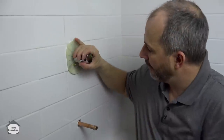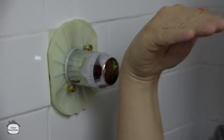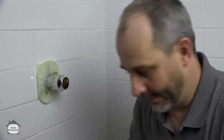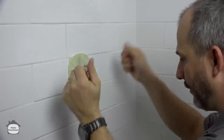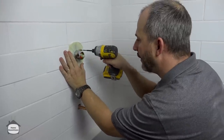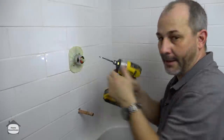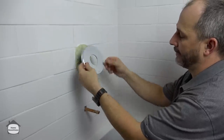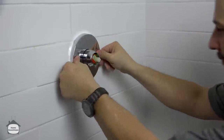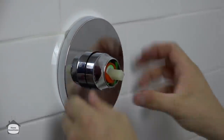When you're installing your valve in the wall, don't be afraid to install it at just one degree slope — that way all the water that gets into that valve will drain out. There's a gasket; tighten up your screws, just snug — don't over-tighten, it's made of plastic and you'll destroy it. After that, set it so the company name 'Reovel' goes at the bottom, snap it in place — no screws. If you ever need to remove it, just get a good hold and give it a tug and it'll pop off.